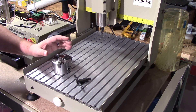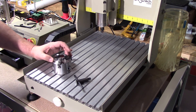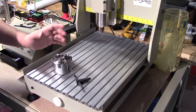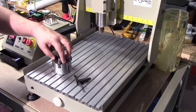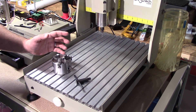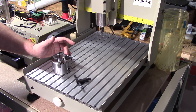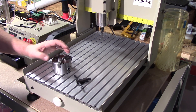What I did is I took the chuck off the fourth axis that came with the machine and mounted it directly to the bed. This comes off the fourth axis chuck just via these three screws or bolts here. I actually used some T-nuts I got from OpenBuilds that went on the back — they were the perfect length to fit in here.